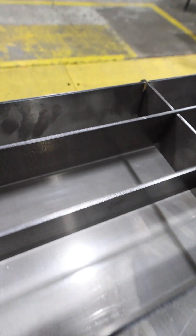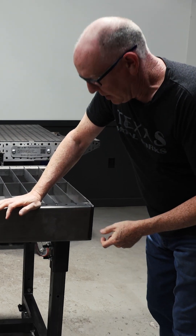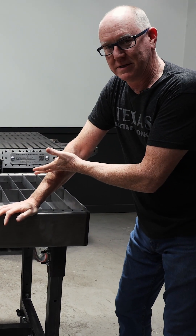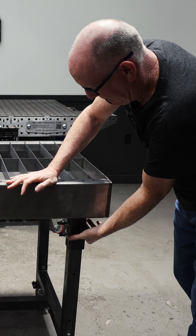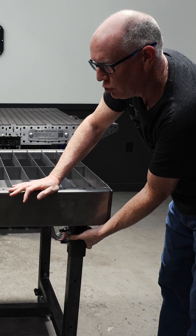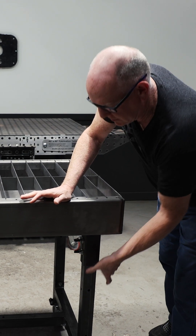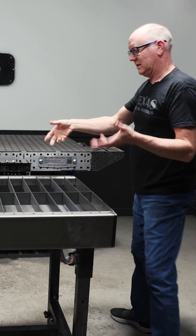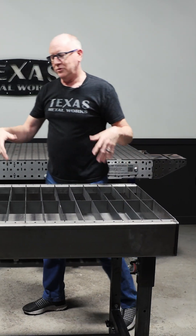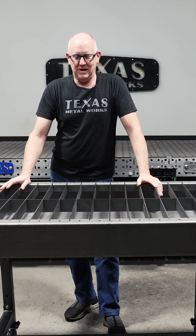So whether you wanted to use an ArcDroid or build your own small CNC plasma setup, one of the last things I'll point out is we're handling the legs differently on this table because we didn't want to cut holes in the bottom. What we did was add some little tubes to the bottom which are welded on, and then our normal table legs can insert into those tubes. That way you can take the top on and off, move it around, and use different legs if you want. That was our clever solution to not having any holes.